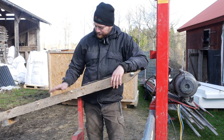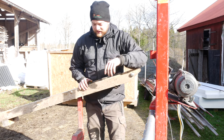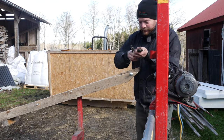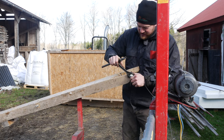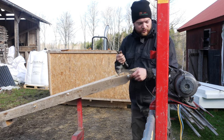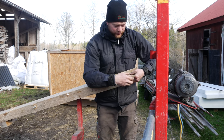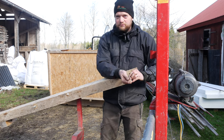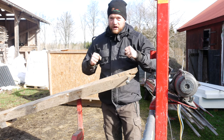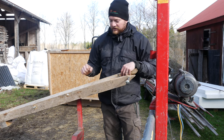So through this pulley system here, it puts way less tension and strength on the winch. We're really glad that we built it out of birch. The reason why we did that, even though birch tends to rot much quicker when it's outside, it's really important that this trailer here is parked under a roof. But the reason we use birch is because birch is just much tougher. The whole frame that we screwed the OSB against, we used birch just because you can use thinner, smaller dimensions and just have the same stability. It's just very tough wood.